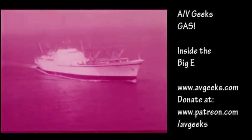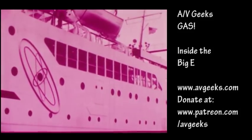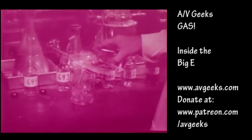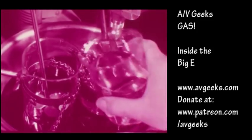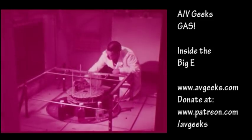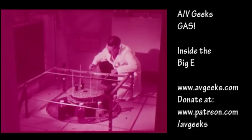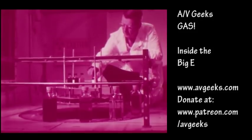In addition, another nuclear-powered vessel designed for commercial application, the NS Savannah, served as a floating laboratory for the testing of the petroleum industry's lubricating oils. Besides this testing aboard the Savannah under operating conditions, one of the world's largest research laboratories, owned by an oil company, conducted further tests and screening of the many and varied lubricants required for nuclear applications. One such test was the exposing of oils to the gamma waves of cobalt-60, to determine their stability under any unforeseen exposure to radiation. In each test, the aim was to select the best lubricant for the job.